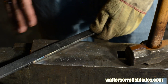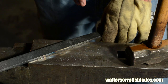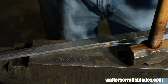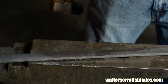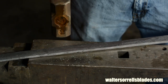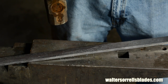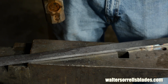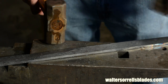As I get closer to the tang, the blade starts to get a lot hotter, and at a certain point I'm going to have to transition to tongs. I hate using tongs. If you're using tongs on a knife that's shorter, you're able to put a lot of leverage on it. But a really long blade like this moves around — I just don't have any leverage because I'm holding it way out here. It tends to move much more each time I hit it with the hammer than it would if it were a shorter blade. That's only exaggerated by using tongs, which decrease your control. So I try to stay away from the tongs for as long as I can, but probably by the next heat I'm going to have to jump in the tongs.